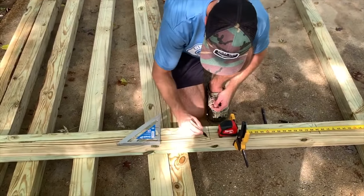Always follow the manufacturer's instructions, but if you live in the high wind zone, you may want to install 6 nails per shingle. Continue to install the first row of shingles by positioning the back of the shingle so it's in line with the chalk line established previously, and then install 4 nails if you live in a standard area or 6 nails if you live in a high wind area, installing the nails within the target nail zone as shown.